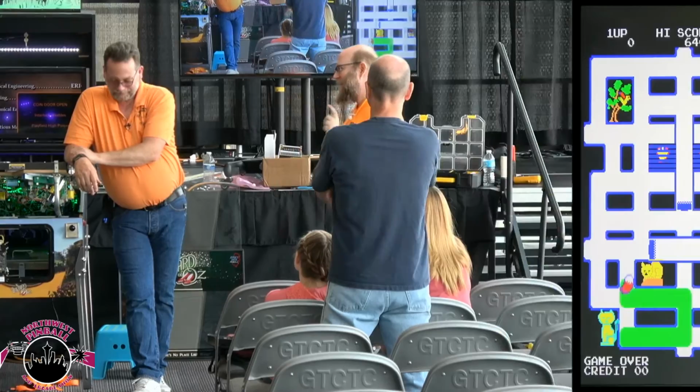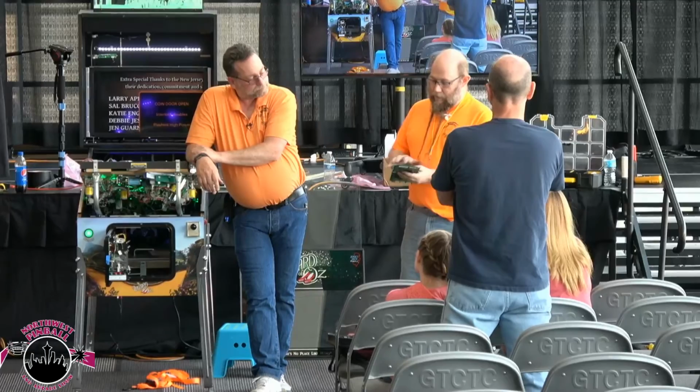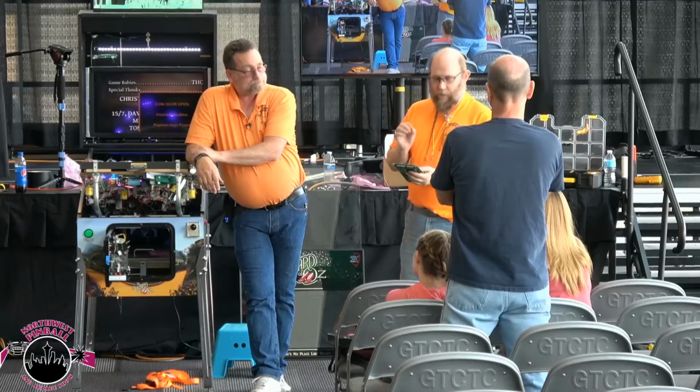So that's how I'm going to end up doing it. That's how I would pull that. Cut them, lift each pin, and then come in with the heavy flux. Go in, suck each of the sites.